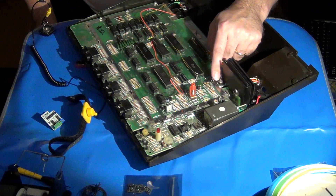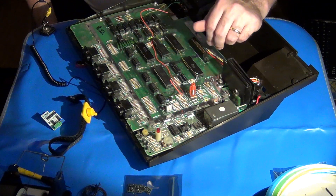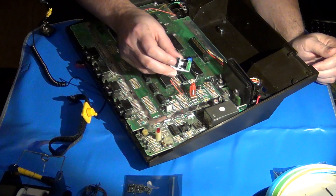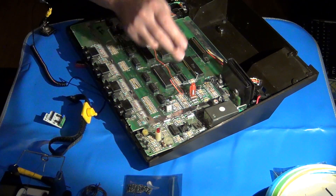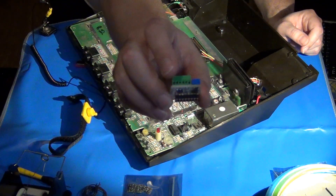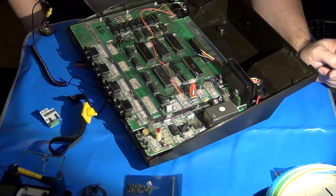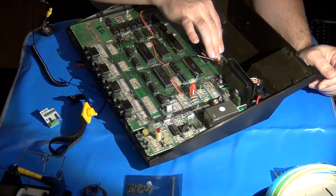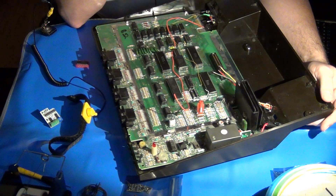The other thing required if you do that is there's a jumper you'll have to install across R2 and R3's resistors up here by the 7805 regulators. I've got this large jumper here as a temporary while I was working on some things. The easiest installation is to get the fully populated version of the UAV board from Brian, remove the 4050 from its socket, pop it in place, wire everything to the terminal header. However, that doesn't seem to work for this 5200 - it will not work at all without a 4050 in it, so I'm going to have to rethink the process.